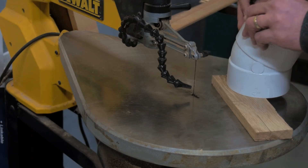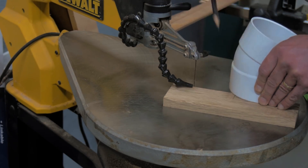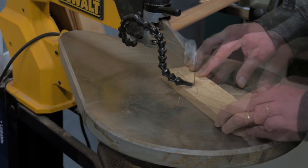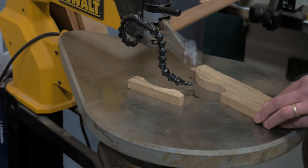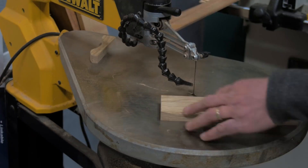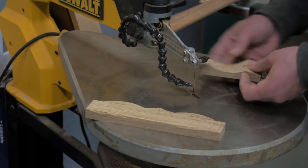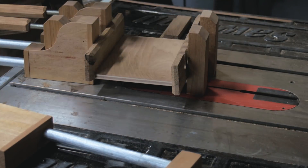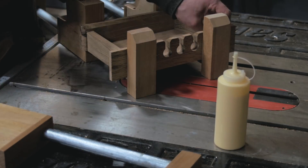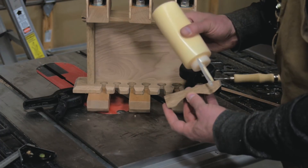I'm making this a little bit of an arts and crafts style, so creating some corbels here — I think that's what they're called. This is really simple; I'm not doing any fancy joinery. Everything's going to be glued to start and then once it's all put together, I'll come back and add some dowels for joint strength. This doesn't have to hold up to anything. So gluing it to the back and clamping that in place, letting that set up a bit, and then gluing on those corbels.